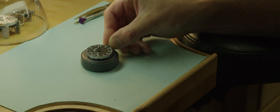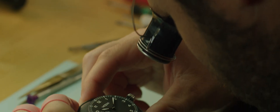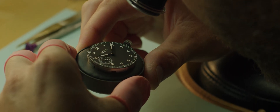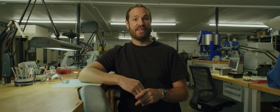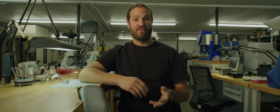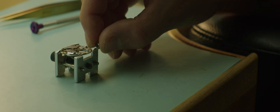There are also general case cushions. Case cushions are used when we just need to place a movement somewhere — usually on the casing part of assembly. It's just a flat soft surface to support the bottom of the movement. We never want to put a movement into a case holder; they're not designed for it, and it is a very fast way to damage a movement.